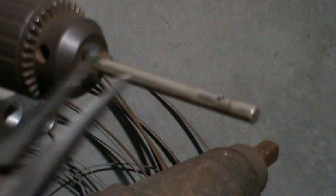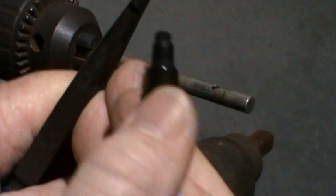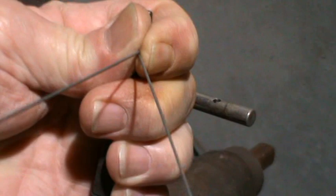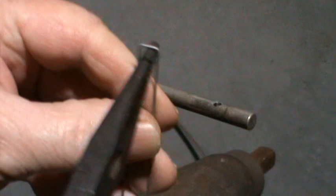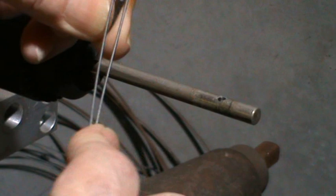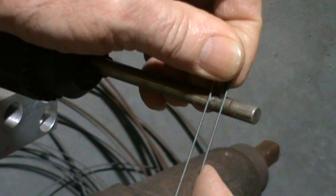That's what we're going to end up with — that pin in that hole. So we'll get our trusty pointy-nose pliers, decide the distance between the wire, and just mark it with the Nikko pen — you can see I already marked it there. We'll then get our straight piece of wire and do our right-angle bend manually, just like that. Now the pin has a cutout for the wire to sit in, which is the correct distance from the center of the mandrel, and we shall put our wire in there like that.